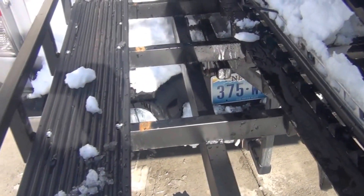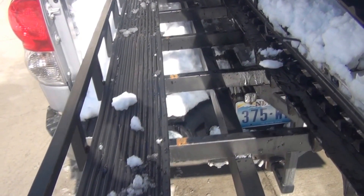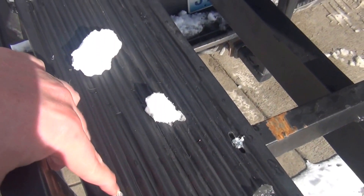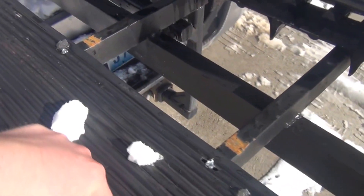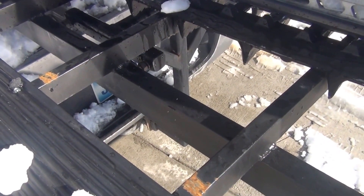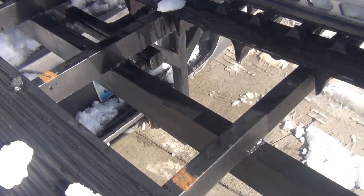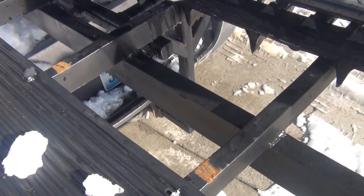The glides you can just pick up on Amazon — tap your holes and drill them in place. Make sure you leave some extra length in the holes so the thing can move around, because heat expansion causes it to move quite a bit. The bottom receiver piece maybe weighs 30 pounds. I used a heavier gauge steel than the 16 gauge of the rest of the system because that's where most of the weight is going to be on.